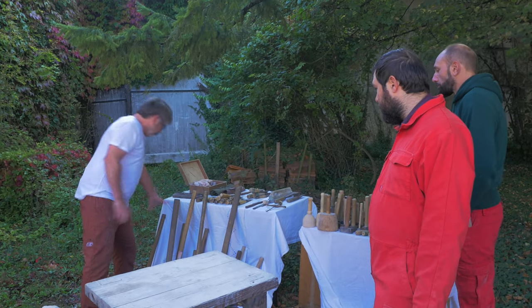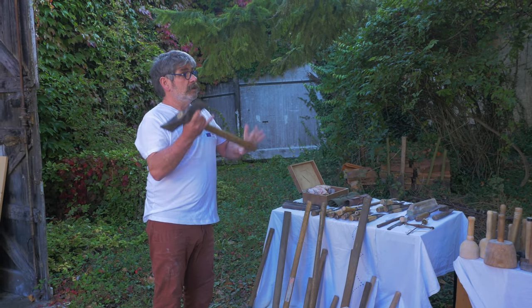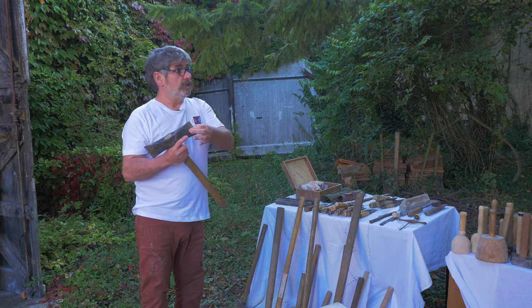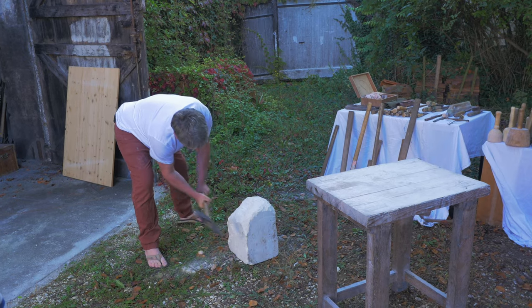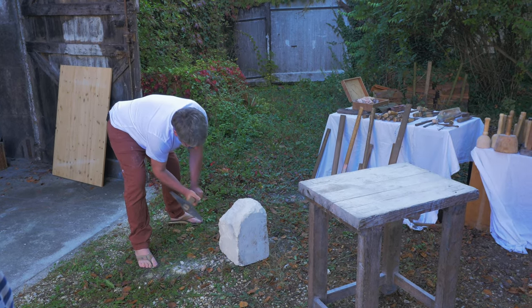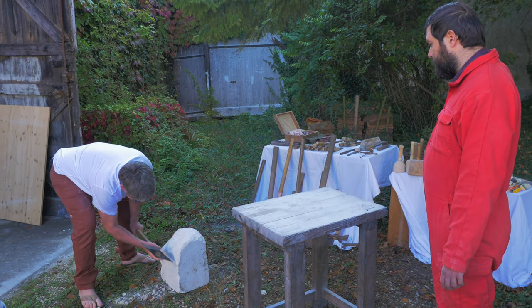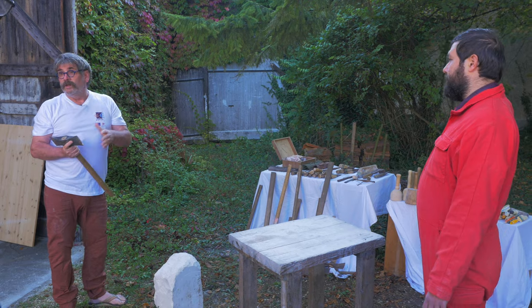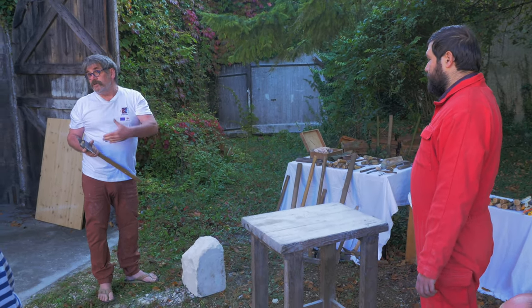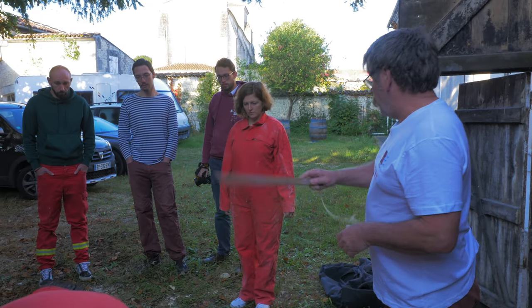Here are the tools — all the percussion tools called 'outils à percussion lancé'. The idea is that you hold the tool with two hands; the active part of the tool is sent onto the stone. If you want to remove a lot of stone you use it like this; if you want to remove just a little, you use it like this. With this type of tool you can go from roughing out — removing a lot of material — all the way to finishing. This is what we see on the churches in the region.